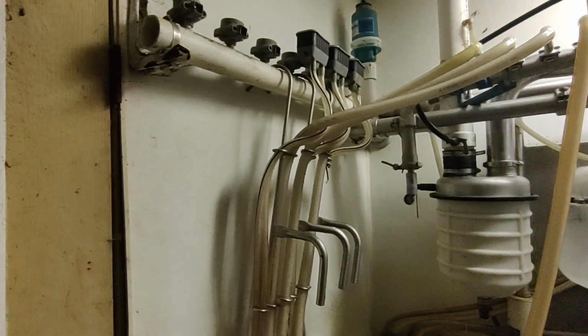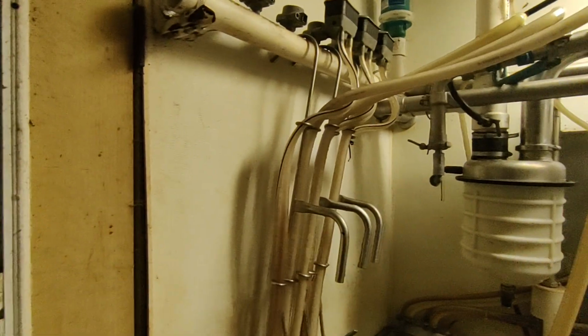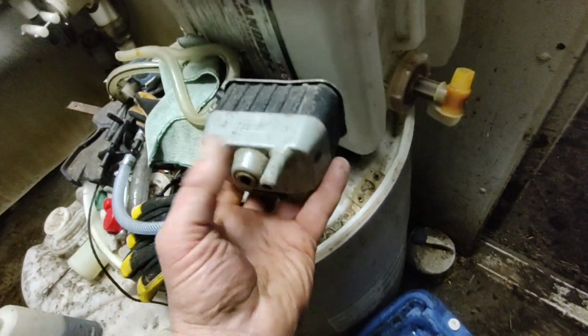But like I said, that's the other thing. Again, if one coil is bad, it shouldn't affect all of them at the same time. And if they were all bad, I don't think, and if it's an intermittent problem like it's been, it shouldn't be happening all at the same time. Because I put an extra pulsator I got on here where I could hear the hissing because I don't have the lines on. And I'd have my finger in the pulsator and I could hear them hit at the same time.